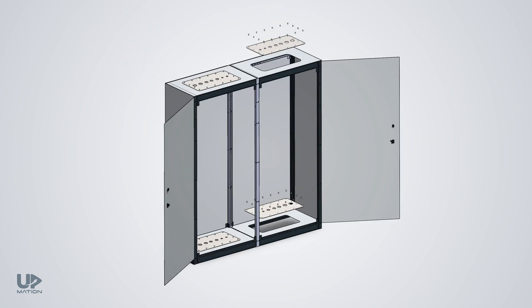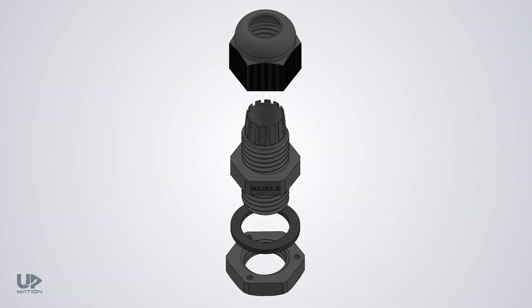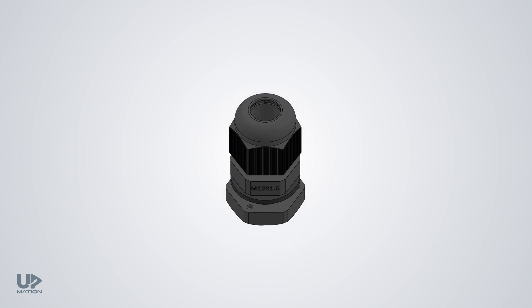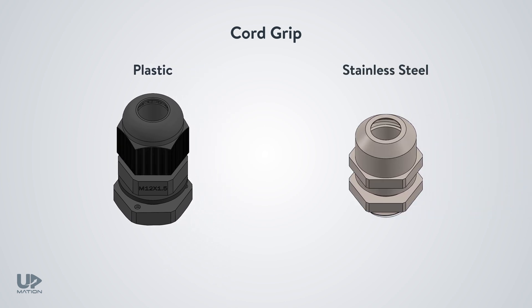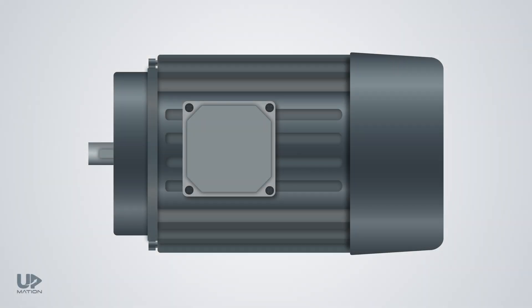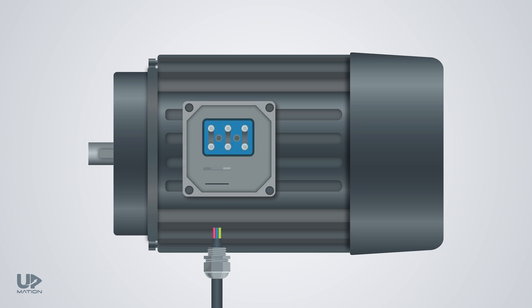After drilling all the cable holes needed on the gland plate, I reinstall and fasten it with screws. But before passing cables through the holes, there is another component to add, known as a cable gland. A cable gland — also called a cord grip or cable fitting — is a piece of plastic, stainless steel, or aluminum with standard sizes to provide proper cable connection to a device. For example, to attach a cable to an electric motor terminal box, I first dismantle the gland, install it on the cable, bring the cable inside the box, and then fasten the cable gland to the terminal box using its hexagonal lock nut.